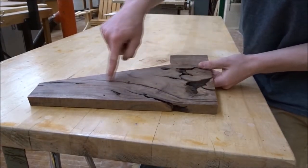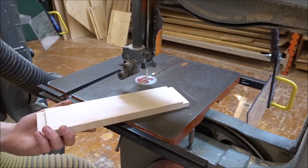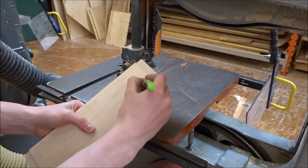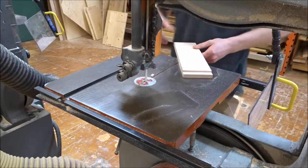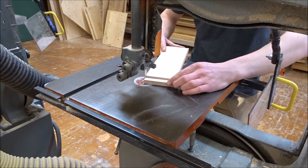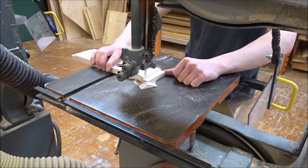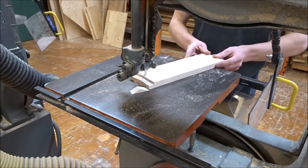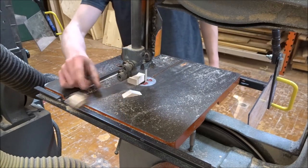So basically, if you have a piece of wood like this that's split down a line where it's just dried out too much, or there's a gap or anything like that, what you want is something that will hold it together from splitting. The way a bow tie works — it's the shape of a bow tie obviously — it's kind of like a dovetail on a dovetail, so it's like two different dovetails. What that does is when the two sides of the piece of wood try to peel apart, they're kind of forced in. It's like a stitch, but it works the same as a dovetail joint that you see on the side of a desk drawer.